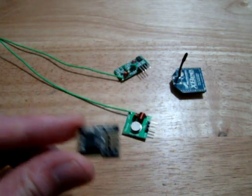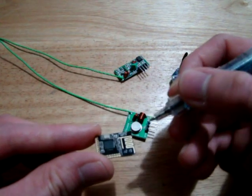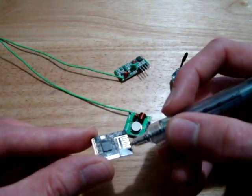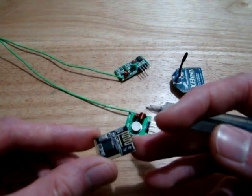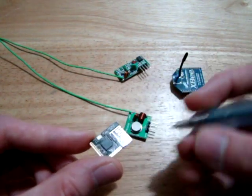So that's how this chip gets so small, it doesn't need a monopole. It just uses an inverted F, and this inverted F would have a better match than the monopole antenna. That's why you have this grounding strip.